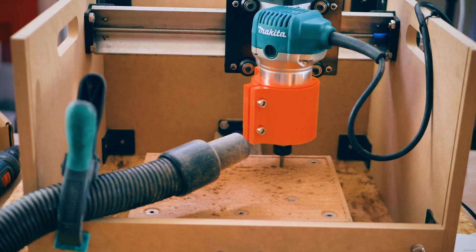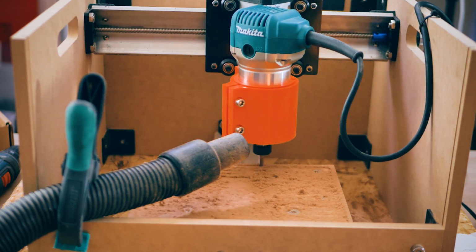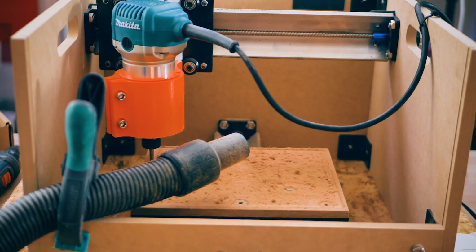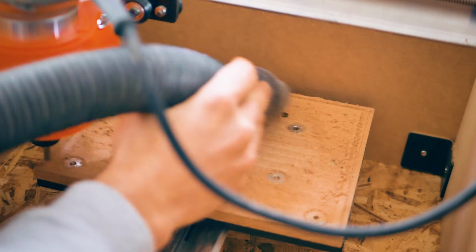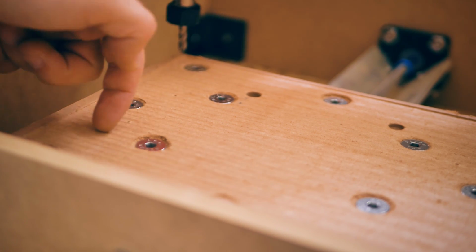That's just a waste plate. And that basically makes sure that it's perfectly aligned to the machine's axes. I put a 6 millimeter end mill in the spindle and just let it flatten the entire bed. And it seems like the spindle on the CNC isn't perfectly square to the rest of the axes and there's no way to adjust it.